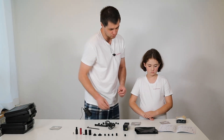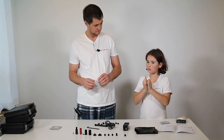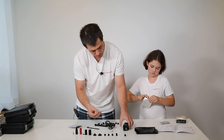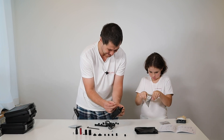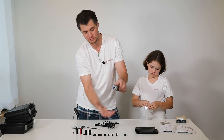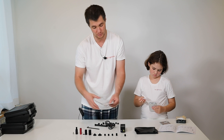We have two more accessories. This is the service key — actually two service keys. Inside we have two keys. The first key you will use to open the cover, and the second key you will use to align the laser to get the maximum signal. Of course, this is a service procedure and may be needed if you drop Miniraman on concrete, for example. This is something we can recommend for very advanced users; otherwise, please ship it back to us.